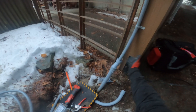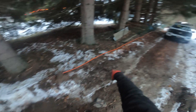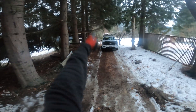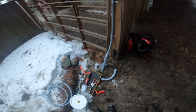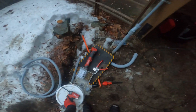I'm going to install duct seal here to seal that, and I just transitioned this way. I initially wanted to do some 45s but I couldn't find any at the hardware store. From here he requested that I just surface mount along the fence the conduit that leads all the way to the back of the property, which you'll see at a later part in the video. Right now I'm just going to do the splice right here and connect it, then go finish over there — probably speed run through this.